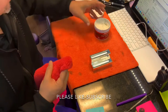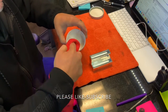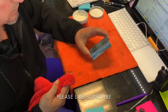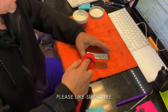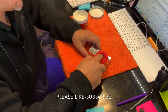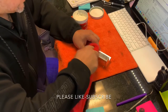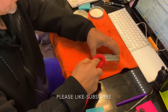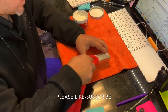So this shouldn't take but just a couple of minutes — I'll show you a couple of pointers and tricks. I like to use a real light coating, not too much. Start on something flat. This just came off the CNC machine, so it was covered in lubricant — I just rinsed it off with water. This one we're looking for a mirror finish, but we're going to leave the machine lines in it, because this is part of our standard line. There's no customizing these.